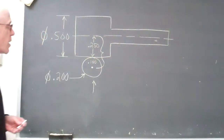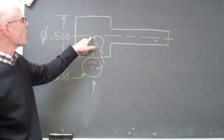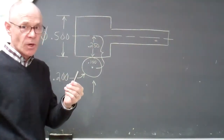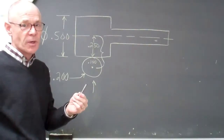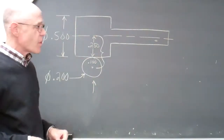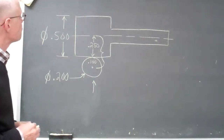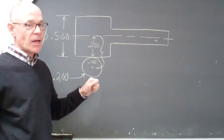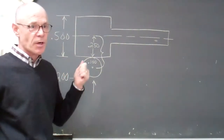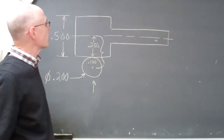So you have three hundred and fifty thousandths in order to get the center of the edge finder over the center line of the piston. The edge finder is going to fit right in one of the collets, which screws into the spindle. Once you get the center of the edge finder over the center line, then any drill you put in your spindle is also going to be over the center line. For the X hand wheel and all the hand wheels, it's fifty thousandths per turn. So you can easily tell how many turns of the hand wheel will cover that three hundred and fifty thousandths.